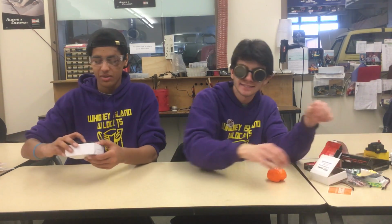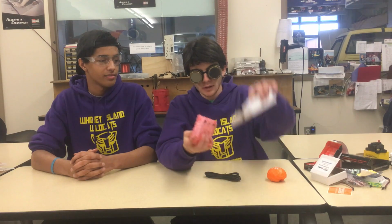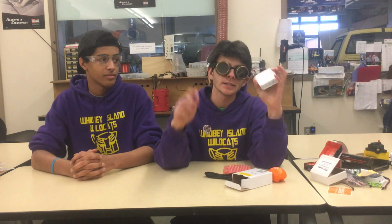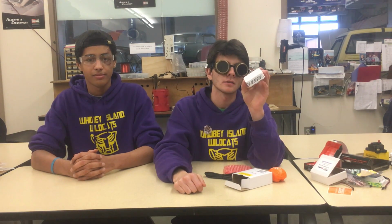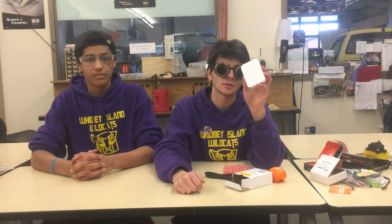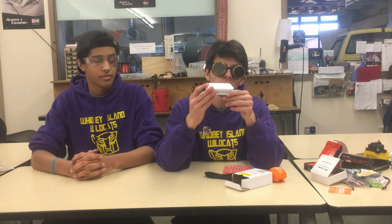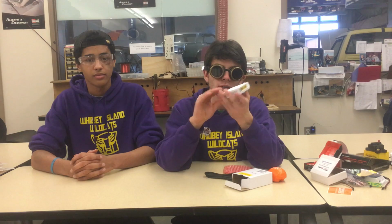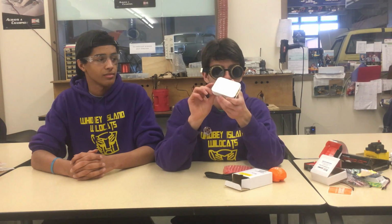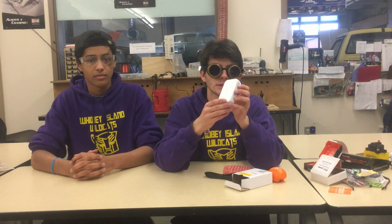No. You've got a radio and radio wire, for wiring up your radio to your robot. Essentially your robot will send out a Wi-Fi signal using this radio so that you can, during matches or even for practice, and I would suggest doing it even during build season. Once you have your robot built enough, start practicing, maybe with just your drivetrain, have this set up properly, and it gives you a wireless connection to your robot through a Wi-Fi network. So on your laptop you'll look for it. I would suggest putting your team number as the name of the Wi-Fi network, or maybe the name of your robot that year, like Steamworks and then your team number.